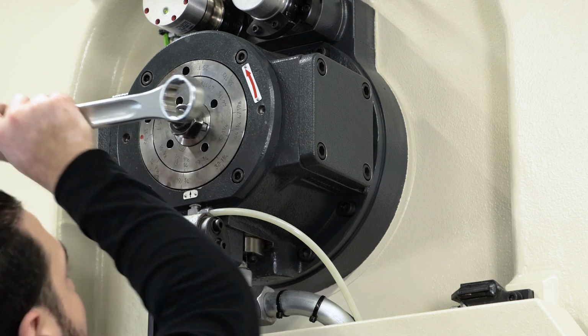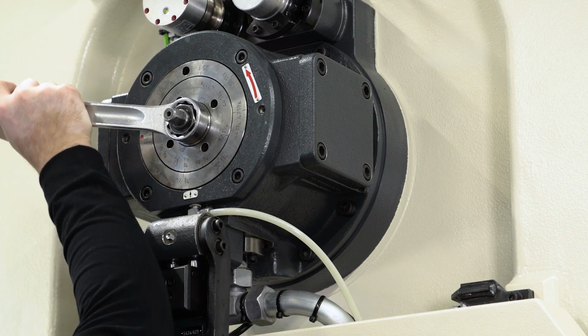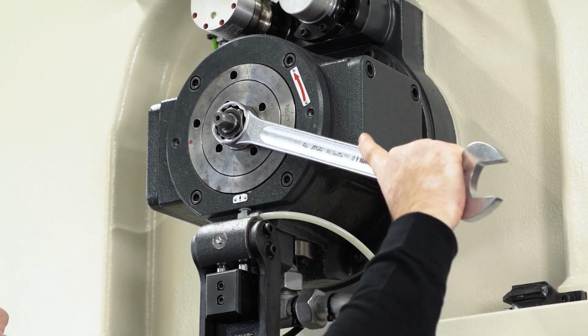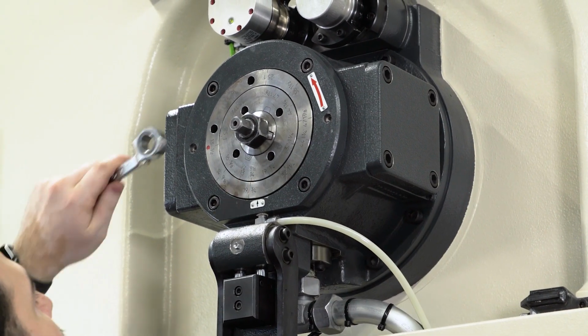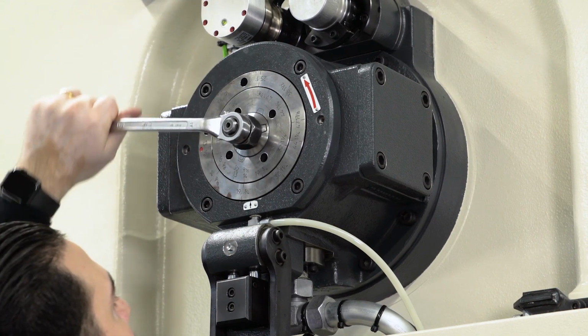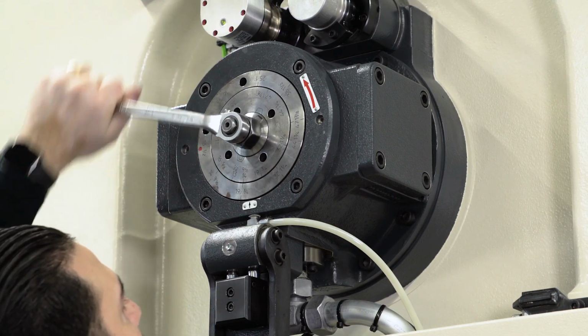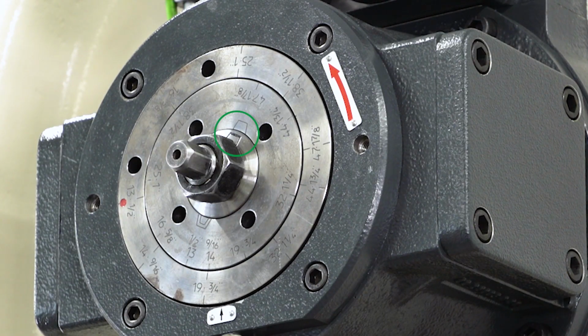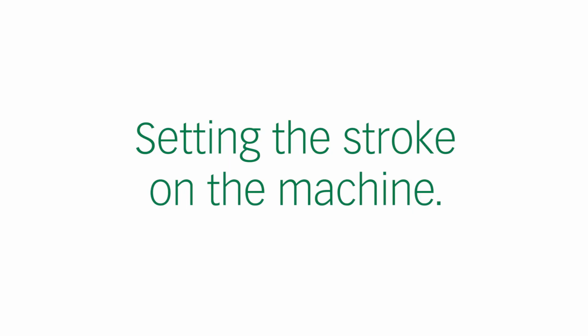You now release the outer nut, using the 36mm wrench, turning it anti-clockwise with a maximum of a half turn. Then place the 17mm ratchet wrench on the adjustment shaft and turn it anti-clockwise in order to set the switch bolt mark to the open position. The pin is now engaged in the hole of the outer eccentric and the switch bolt is open.